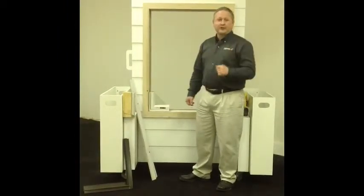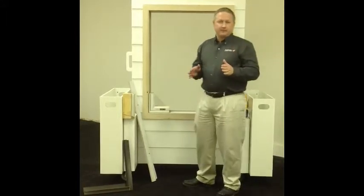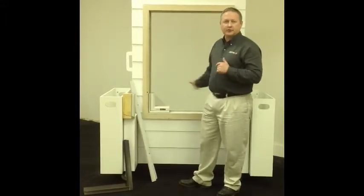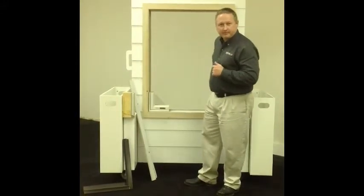Okay. As we wrap up, let's recap what we just showed you. So we showed you how to measure for pricing. If you recall, we said measure sheetrock to sheetrock and add an inch to your overall width and height for pricing. And we also showed you how to do a final measure for ordering. So you would measure from trim to trim, height and width, and you would deduct about 1/4 inch for both. You would deduct 1/4 inch on the width and the height to get your final order.